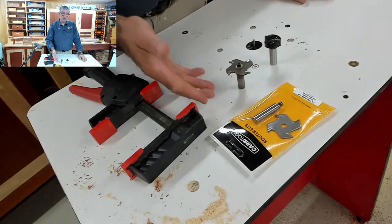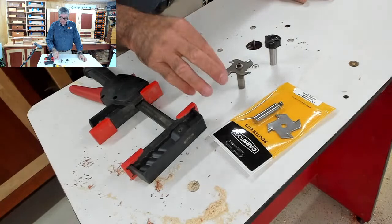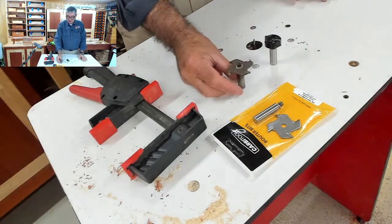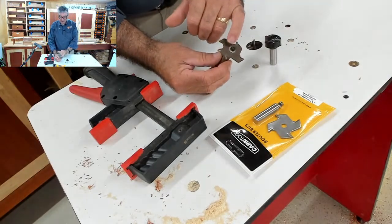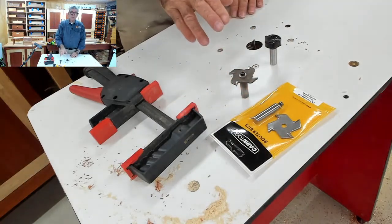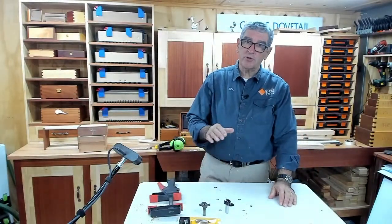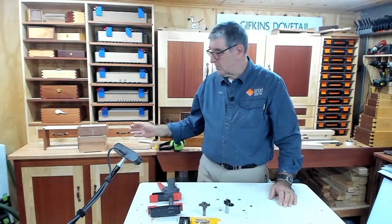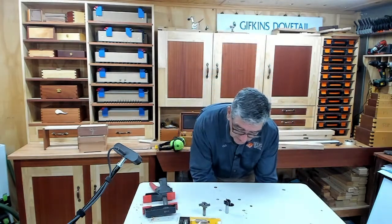So you need to assemble it before you actually start. Now, a 4 millimeter Allen key is adequate to do that sort of thing. So you'll need to put that together so that you end up with this. And by the way, the washer goes on the outside of the cutter. Now, that comes in lots of different sizes. So I use a 6mm for some things, I use a 4mm for something. This is a 3.2, which is adequate for doing the little box that we just did a minute ago. Okay, so the trench for the feet, for the bases.